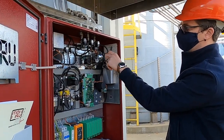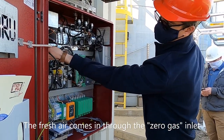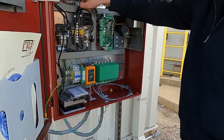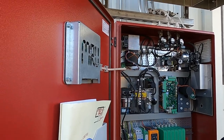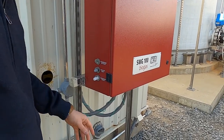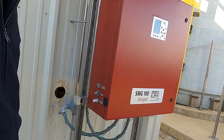This pump here is mixing the gas — this pump is for fresh air, drawn from here. You can see a T-connector here to get the fresh air inside. Since the gas is going through this chamber, the condensate pump takes out a little bit of it, and you get this gas out here as well. So if you have a dilution system, you have to make sure that a hose is connected here going just down a little bit. If you don't have a hose, you get condensate-mixed gas out, it mixes into the zero gas, and it dilutes again. You need to direct the condensate down.